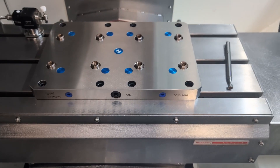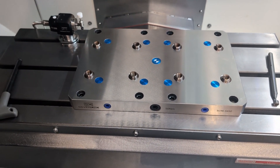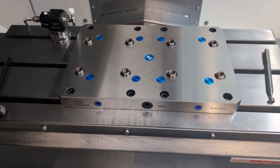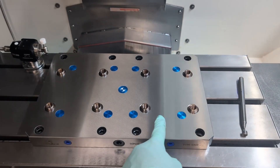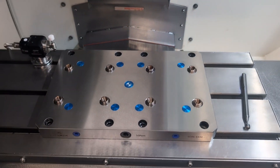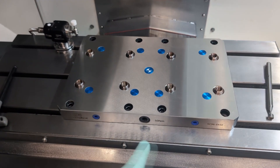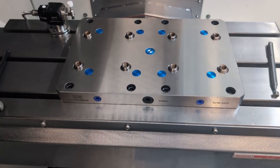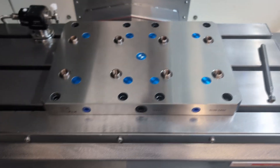I went ahead and used all eight. Before I put it on this table, I cleaned the table very well. I stoned it with a fine stone. I ensured that the mill was level, and then I ended up sweeping in the table on each of these portions, and it's running true. I was a little scared actually — it's running true both in X and in Y. I was very happy to see that.